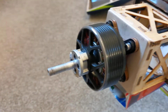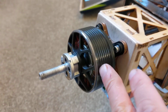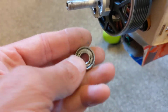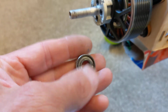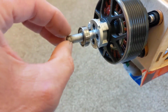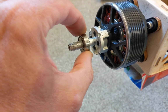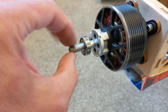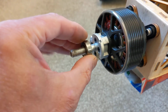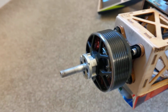Loads of play. So I thought, well, luckily, because I used to do skateboarding, skateboard wheels used to have bearings either side like this. But in between, they had the sense of putting a little piece of tube that sits against that inner face on both bearings. So if you put a piece of tube parallel to that inner ring, there's less chance of it doing that because the tube is squeezed between the two. So it was not as much movement. Not that it matters, but I thought that's what the vibration were. Nothing to do with that, probably, but it's helped. It feels better.